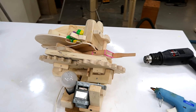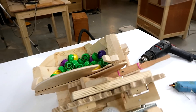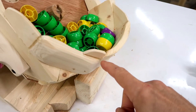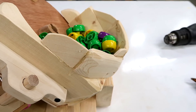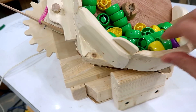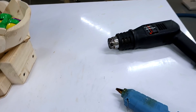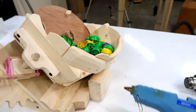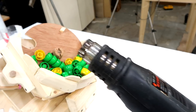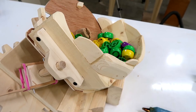The whole machine is very much a prototype hack in that whatever I temporarily jigged together to try it out, I just kept adding to it. And because I didn't want to wait for glue to dry, all the joints and stuff like that are just put together with hot glue. Hot glue is a bit like welding in that you can fill large gaps that way, which makes it easy to put together things that are not very precise. You just squeeze some hot glue in there, and the hot glue is actually surprisingly strong for joining wood as long as it has a good chance to bond. What I do is preheat the pieces before I put the glue on so that it doesn't start to harden right away, and that way I can squeeze the pieces together and get a nice tight joint.